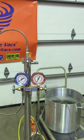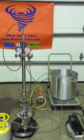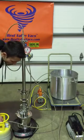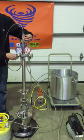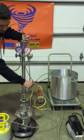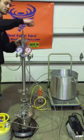Let's assume we've completed the extraction. I'm going to show how to set up the system to recover the solvent and get it out. Once I've seen the liquid go clear, I'll open up the valve on my tank. But the system doesn't know where to put the solvent, so I start by closing off this valve to isolate it. The solvent is still being pulled, so I wait a moment and look at the sight glass to make sure it's cold and dry. Then I can close this valve once it's dry.